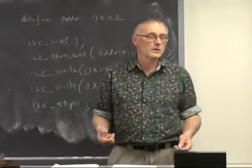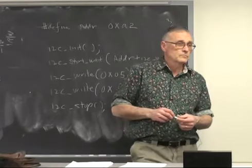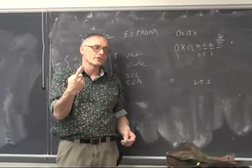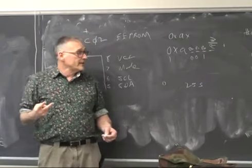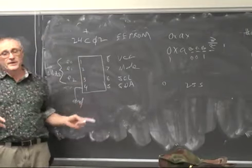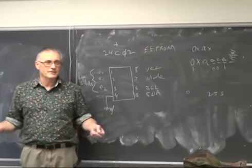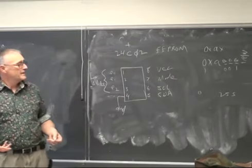Do these external EEPROMs have longer lifetimes than the ones on the system? Those are 10,000, if you're writing this in software. So the question is, do these have a longer lifetime? There are 2 possible lifetimes. One is the number of write cycles you can do on the EEPROM, and the second lifetime is the data retention time. The data retention time, both for the EEPROM internal on the Mega 644 and on these devices, is some long time, 10 years, something like that. Now, how they managed to keep 1,000 electrons on a gate for 10 years, it's absolutely amazing. It's a really high resistance.